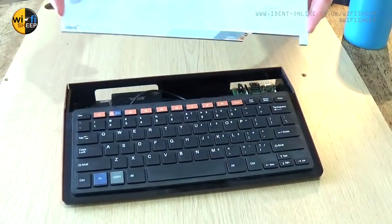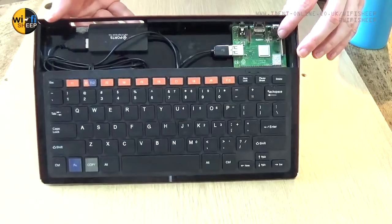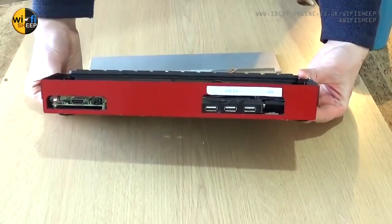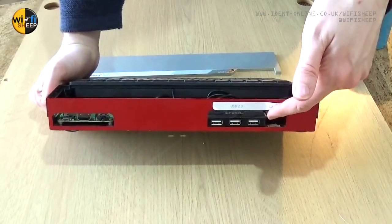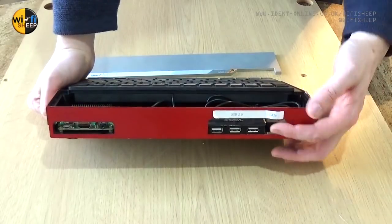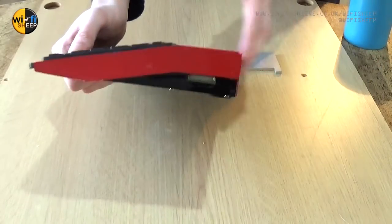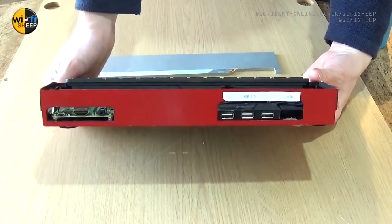This is the basic kit - the perspex lid comes off, and inside we upgraded with the new Raspberry Pi 3 A+ board. We have an internal USB hub, and an off-the-shelf wired USB keyboard. The rear of the computer was very basic - simply two holes cut in the trim with paper labels that have started to come off. You had a hole for the USB hub and space for a Cat5 ethernet connection. What I'd like to do today is replace that rear panel with a proper power switch and power supply plug, reconfigure the USB, and create a nicer blanking plate.